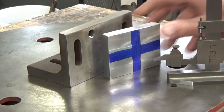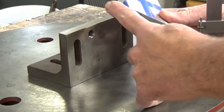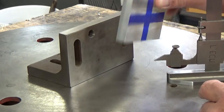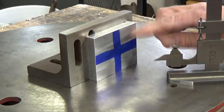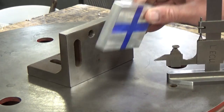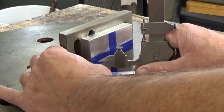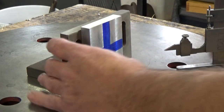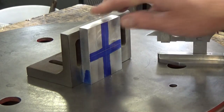I have my part, and I used a Sharpie for the layout. I put a little blue mark on both reference surfaces. When I scribe my line, I'll be sitting on this reference surface and then bring it up to scribe the second line while staying on that reference surface. This is important — you don't want to flip-flop your part around. When we head to the mill, these are the two surfaces I'm going to edge find. If I get lost, I'll know which surfaces to come back to. First line at 1 inch 346 thousandths, and our second line at 1 inch 703 thousandths.